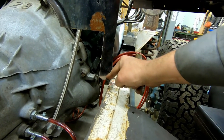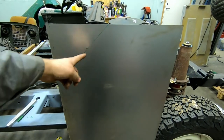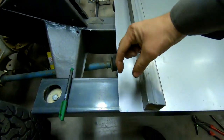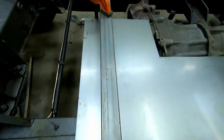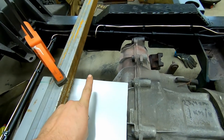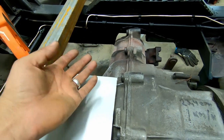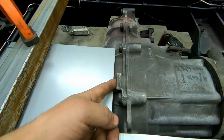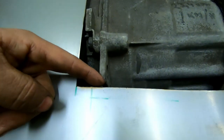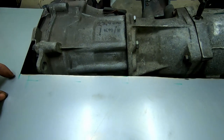When I measure that in, I got exactly where this little lip is plus five millimeters, so this can move a bit when I get it attached. So I'm going to cut this corner off anyway — 20 millimeters here, fold up, 20 millimeters here, fold this up so I can attach it to the other side. It's much less flimsy if you fold it up rather than just weld it.